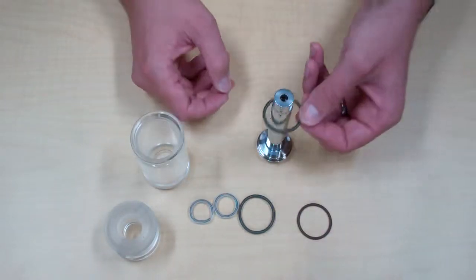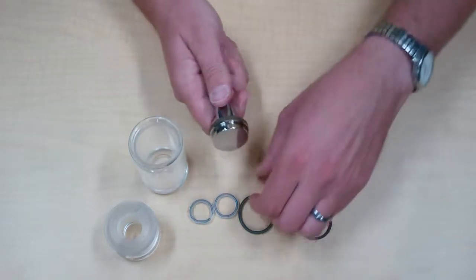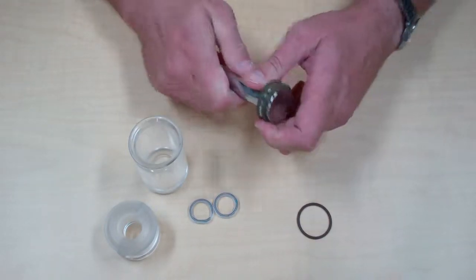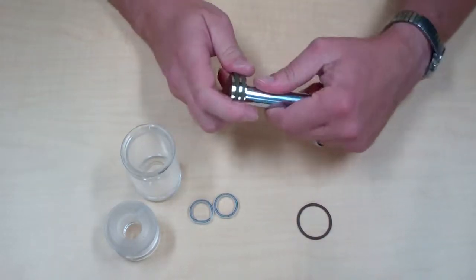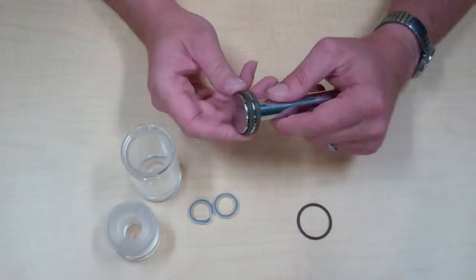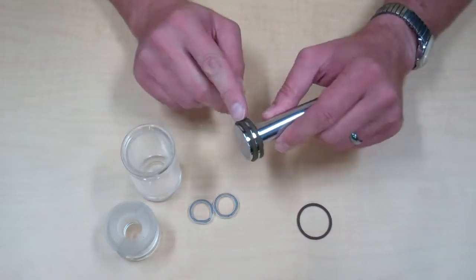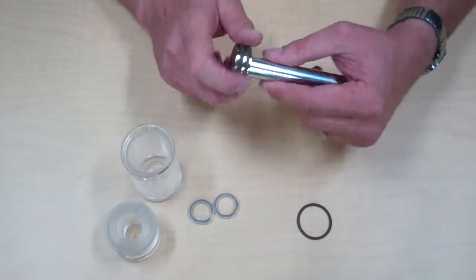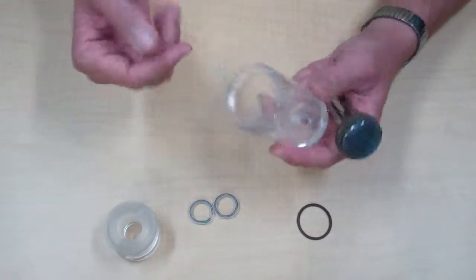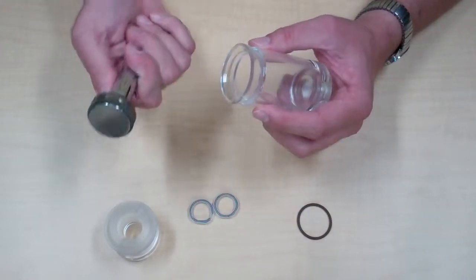You can install your piston seals onto your piston. For lubrication, we generally recommend the use of a Krytox lube or a moly coat — the medium 33 works well. You can lubricate the seals and inside the barrel. For the demonstration, I won't use any lubricant.